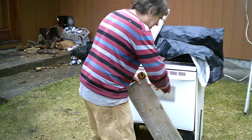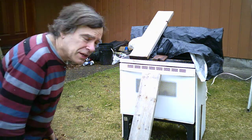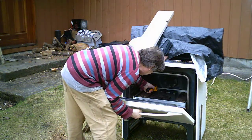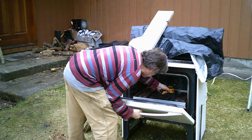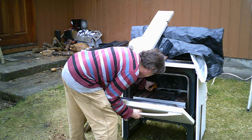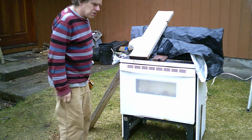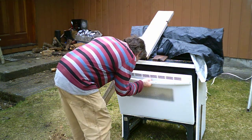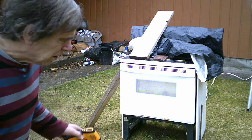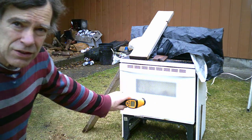I'm going to give it another 10 minutes. Now we're over 80 minutes — we'll check the temperature again: 227, 234, 213, 225. There's some plastic bubbling around the edges now, so I think we'll call it ready to turn off, and then leave it for another 15 minutes while the plastic continues to flow around.